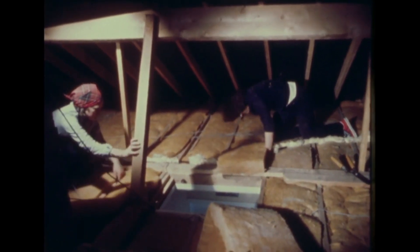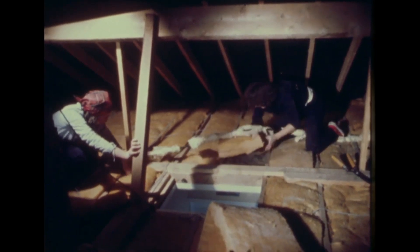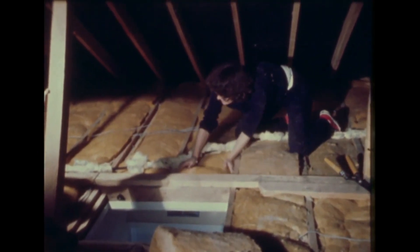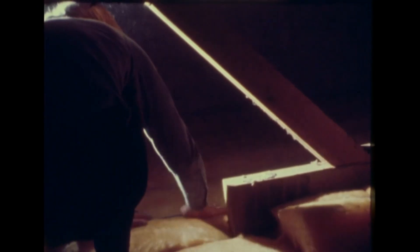Make sure that all cables and pipes are kept above the insulating wool. Lagging the pipes and the water tank is also important. With the proper insulation, the attic should be colder and therefore more likely to freeze the water. One of the most uncomfortable and dangerous aspects of the fiberglass wool is the dust, which is extremely irritating to the skin. The best way to minimize the dust is to work slowly, and an added safeguard is to wear a face mask.